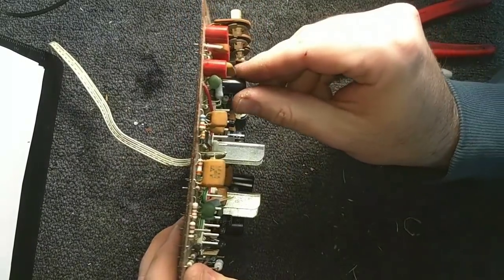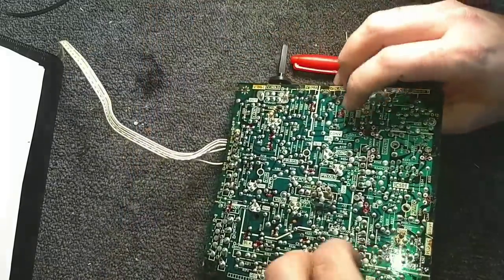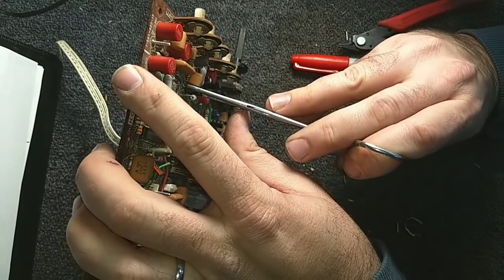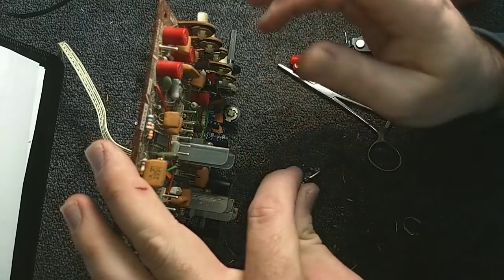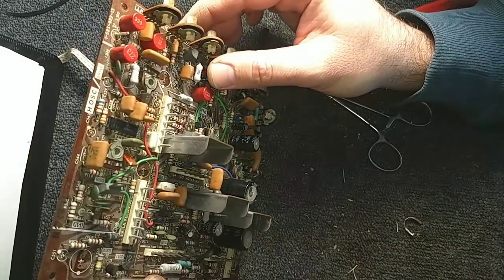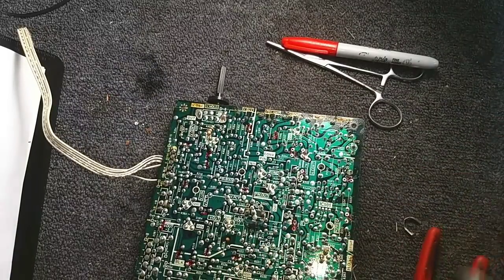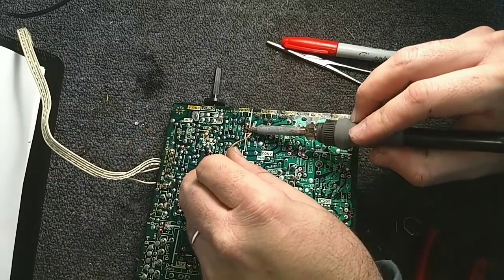Okay. And did I get you already? No, I did not. Desoldered, you didn't yank it yet. There we go. That one was stubborn. Okay, we're getting there. Do this guy here. Gotta remember to keep my wick trimmed so that the solder on the wick doesn't flow down into the fresh wick, and that's a waste.